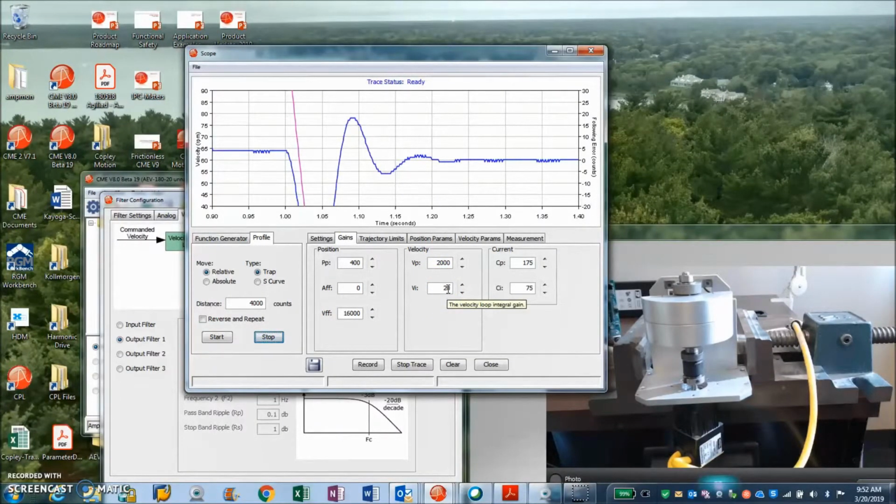Large inertia is usually a small integral. No need to worry about the feed forward term. That's just the error while it's moving. 16384 is the default. But I thought, hey, it's okay. Let's try to come in for a smoother landing. We'll just allow the error to build and then settle it out after the move.